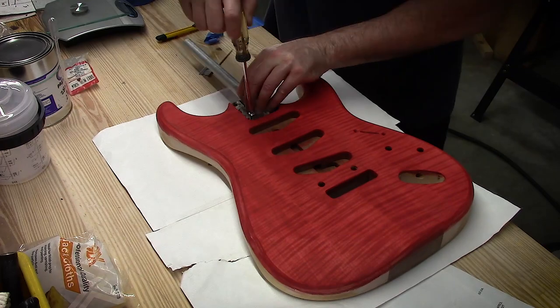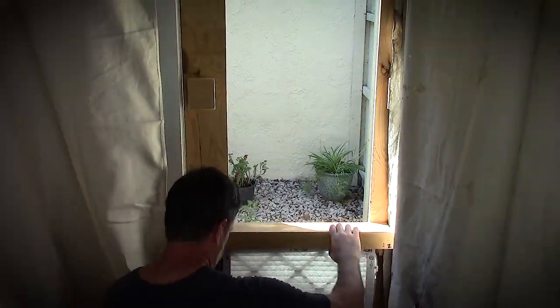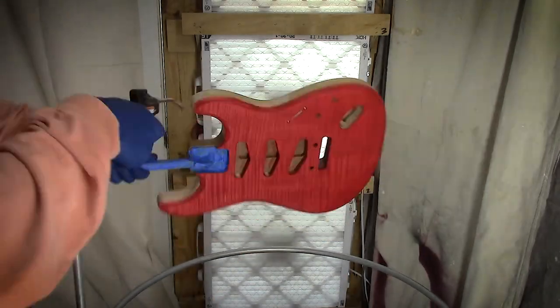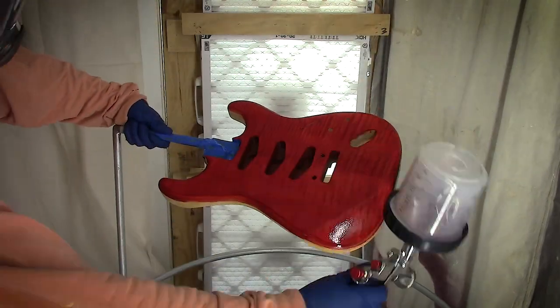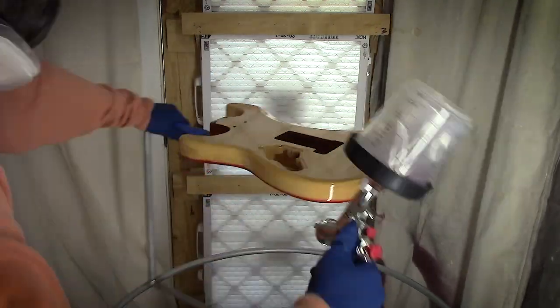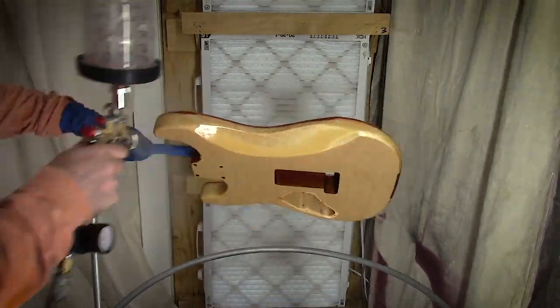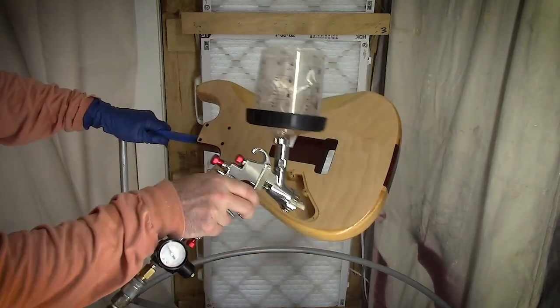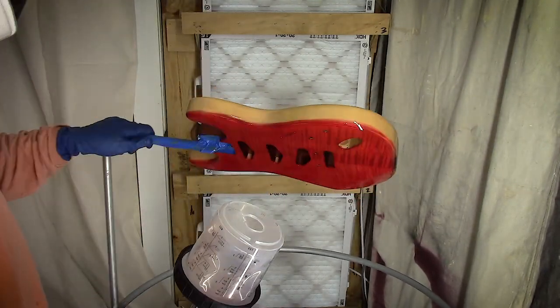The red dye is on the body, looking good, and we're going to leave it alone. I'm putting together my exhaust fan system — three 20-inch window or box fans — and we're going to shoot on a coat of Simtek Easy Sanding Sealer-type material. I'm using an LVLP paint gun with the biggest tip it has — I think it's a 2.0 tip — and it sprays really well. Another pretty heavy coat. This stuff is catalyzed, so it stays sticky for about 20 minutes, then gets gooey, then gets hard. But it's looking real good.